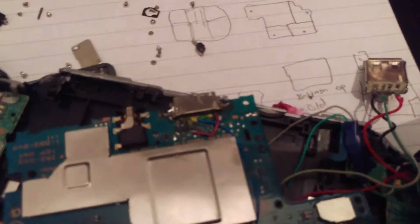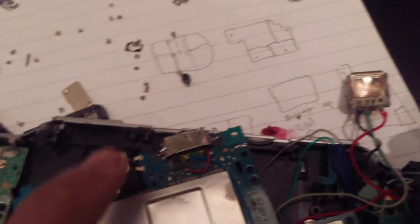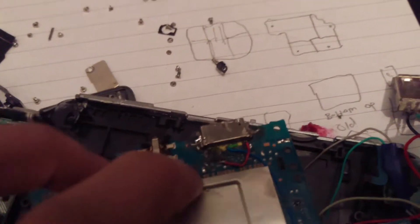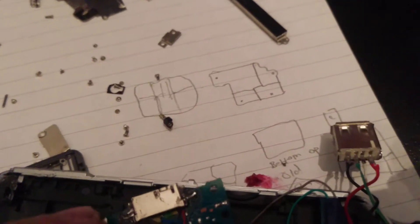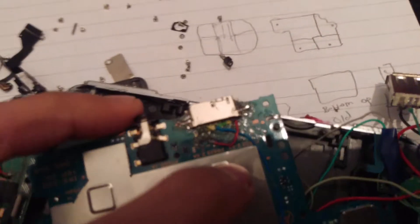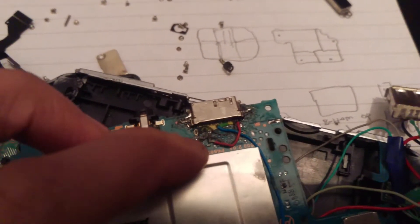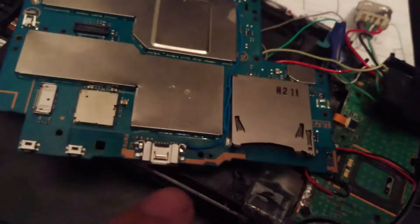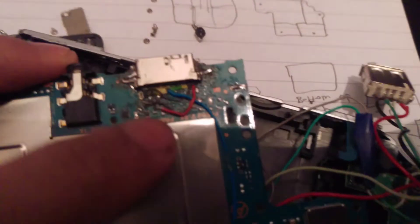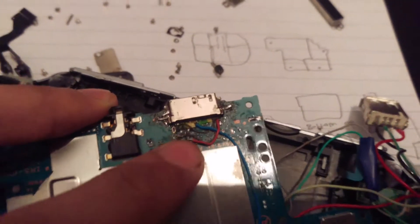Let's explain everything going on here. With shitty soldering equipment, I screwed up the ferrite bead, but that doesn't really matter — the ferrite bead is actually fine to be honest. One of the problems I came across is that it wouldn't charge, and I sat there scratching my head for days. I had to just bridge the VCC past the fuse here, and on the ground I carried the signal all the way up to here. As for the mappings for this certain port, I'll release it in the description.